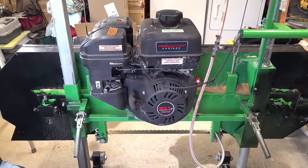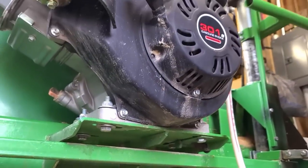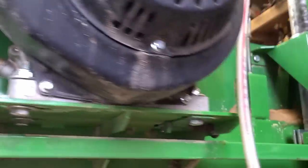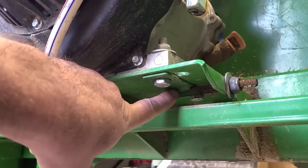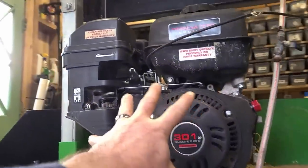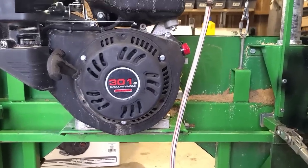To give you an idea of how this one's on here: the engine's got four bolts on the bottom — engine mounts — and then over here it's got a screw that is welded. What that does is move the entire engine linearly left and right to put pressure on the pulley system. All this is is a centrifugal clutch on a V-belt groove pulley, which goes around this bandsaw wheel and drives the blade. The tension for the engine is in that bolt I just showed you.